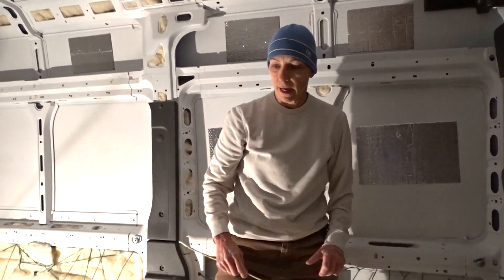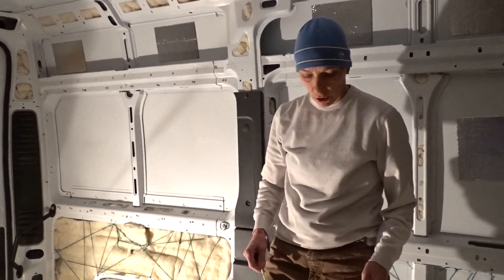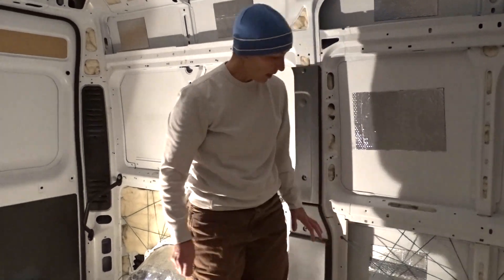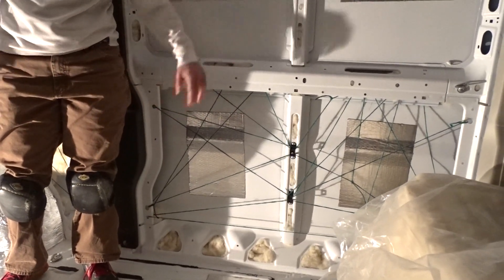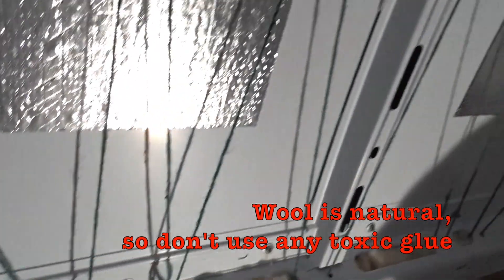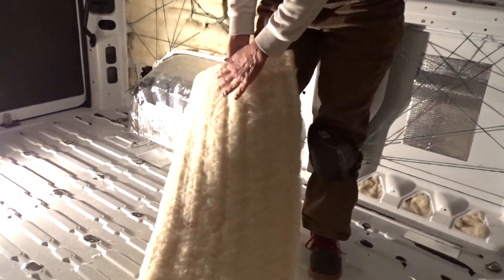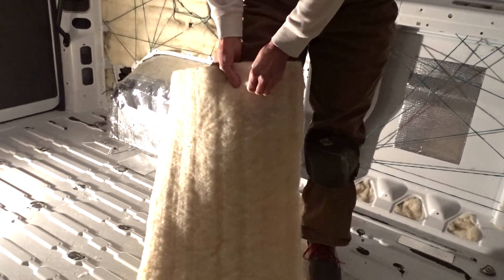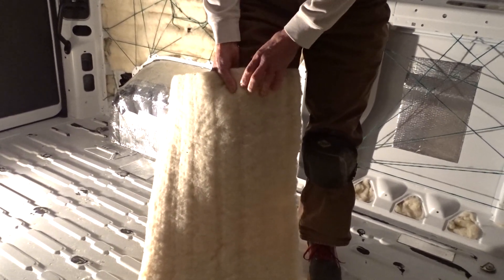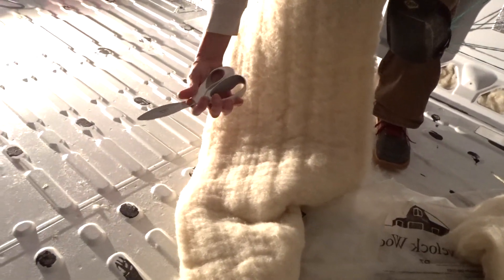Working on insulation today. We're trying to get the insulation up and then get the wall panels put back on. We've got webbing in spots where we're trying to get full bats of the wool insulation, and we've used green twine so the green will be more visible against the wool. The wool has two sides — there's the scrim side, which is very dense and woven, creating almost a fabric that's very hard to tear. On those sections we'll cut it with a pair of high quality Fiskars scissors with comfort grip.